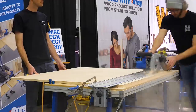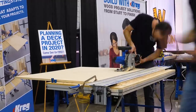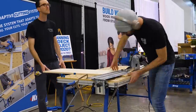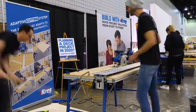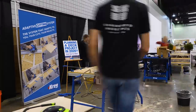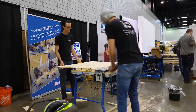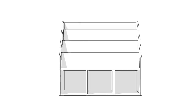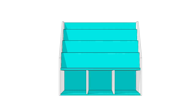So far all I've been doing is very roughly breaking down my plywood and removing some factory edges. Once that was out of the way, the next step was to set a stop at 46 and a half inches and cut a couple of my sheets to their finished length. From those sheets I'm going to get basically every piece that runs horizontally, which is going to determine the overall width of the bookshelf at 48 inches.